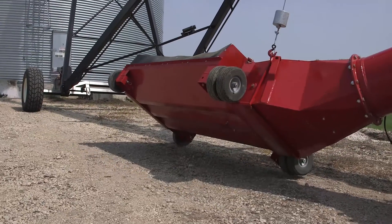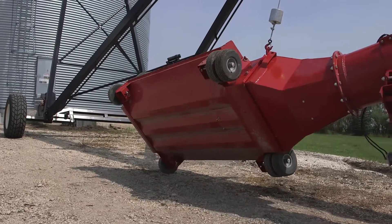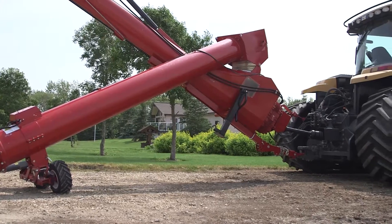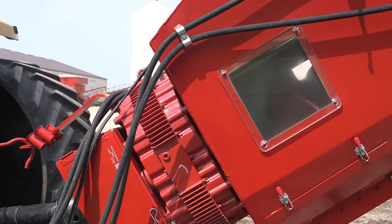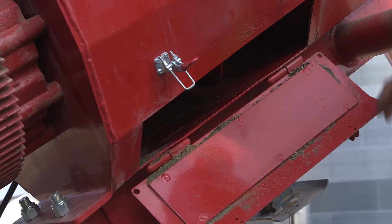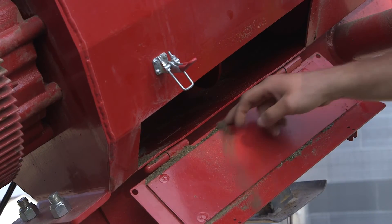The hydraulic winch allows the hopper to be raised and lowered with ease. The X160 includes a speed reducer reverser. The speed reducer lowers the tractor speed to meet the speed required to run an auger, and the reverser allows the flighting to be reversed for easy clean-out.